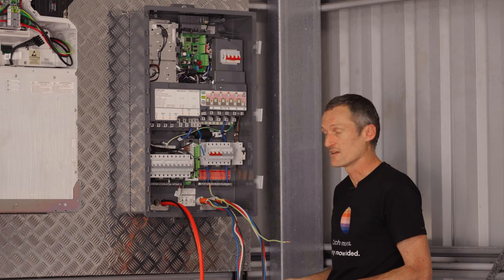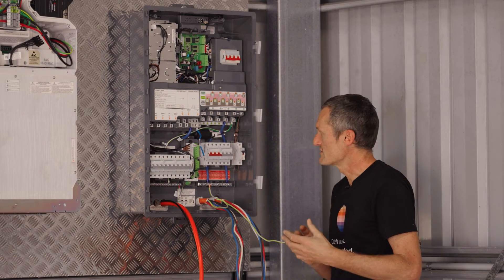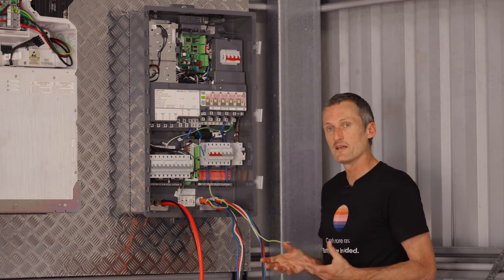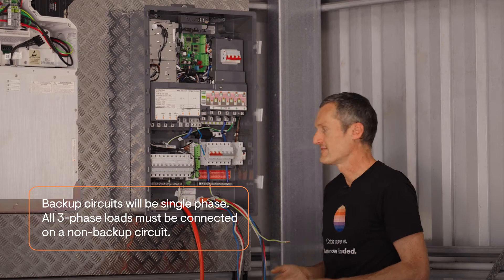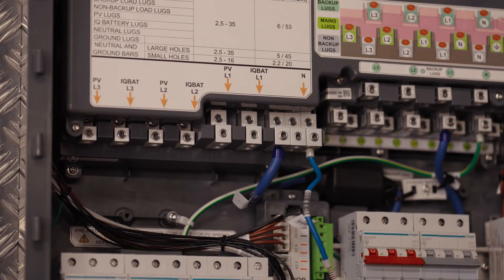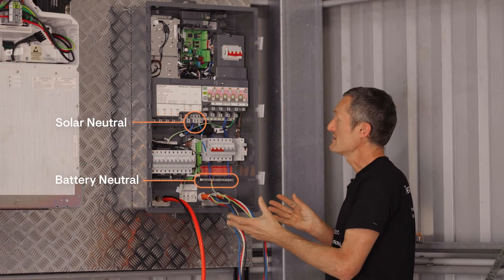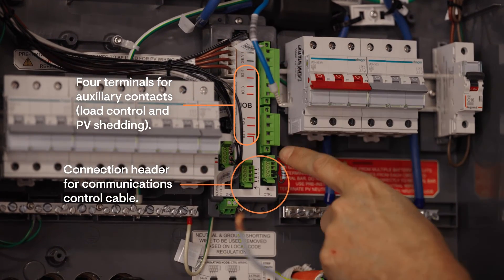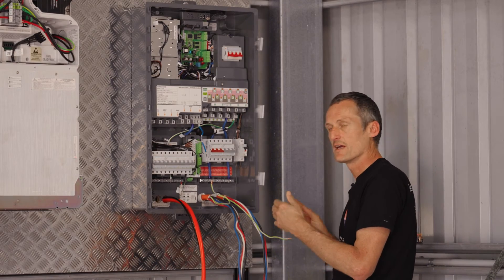Typically 63 amps is the common size breaker, so we've got a 63-amp main grid supply breaker, and then we select our backup and non-backup circuits. Any non-backup circuits in a three-phase installation will be installed onto a non-backup circuit breaker; backup circuits will be single phase and fitted on the right-hand side. All lugs and connections are clearly labeled in the system controller so you know where to land each circuit. In addition to the circuit breakers, there's a communications panel — the IOB — in the center of the board where the communications cable between each of the IQ batteries is fitted, used for communication between the system controller and each battery.